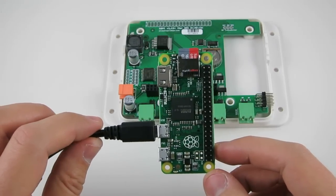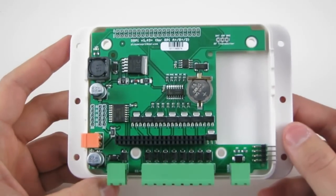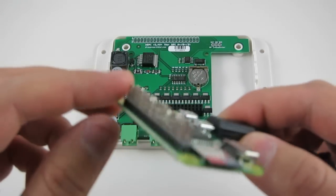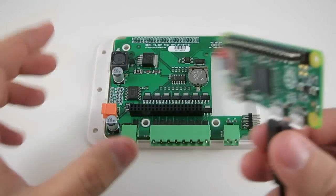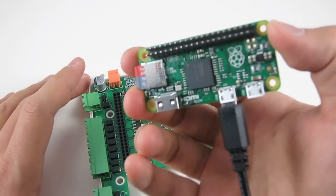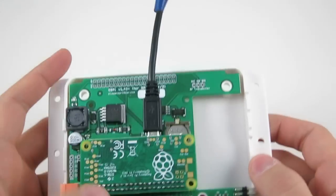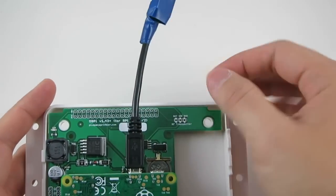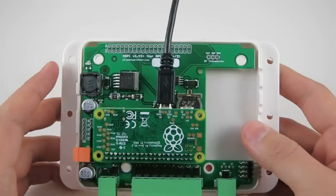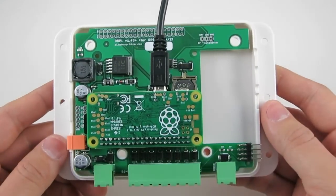The main reason for me to get hands on a Raspberry Pi Zero is to verify that it works with the OpenSprinkler Pi. To do that, I soldered the 2x20 male pin headers, and on the SD card I installed the OpenSprinkler firmware. Then I plug it in onto the OpenSprinkler Pi circuit board. Because this is a self-made cable it sticks out of the enclosure a bit, but when I get my proper OTG adapter, the Wi-Fi adapter and USB adapter should fit nicely within the enclosure.